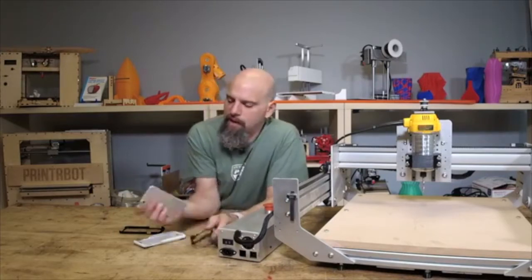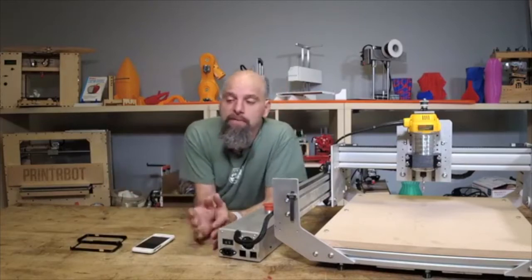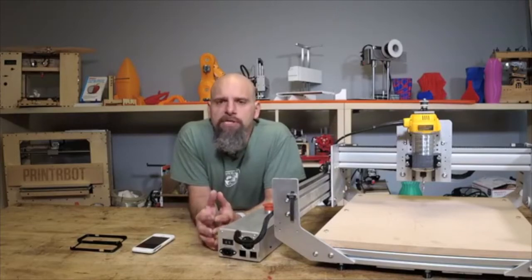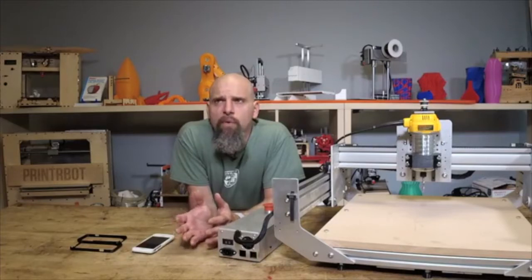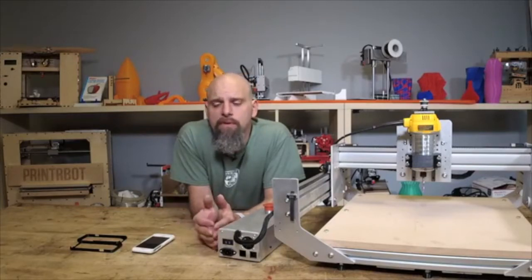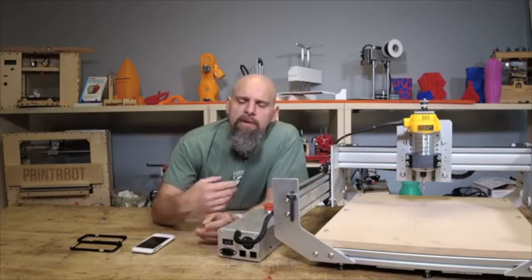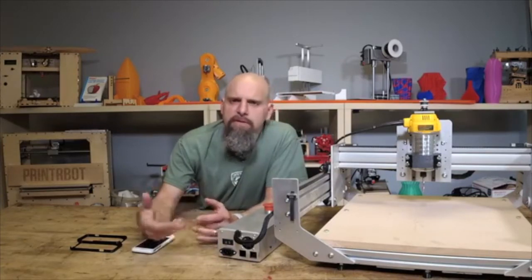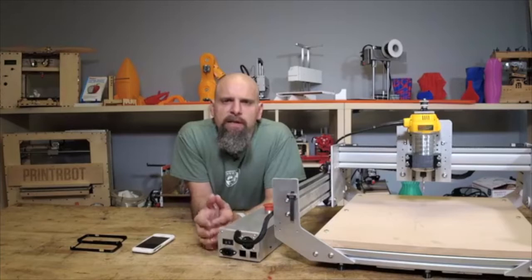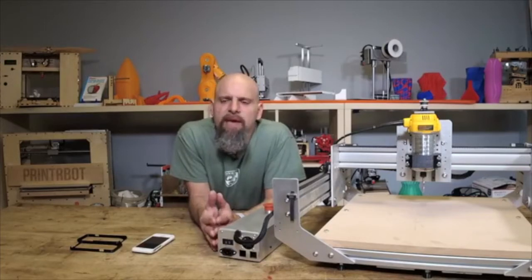Yes, there are a couple of things. There's actually a post-process. I'm getting into nitty-gritty details here, and nobody really cares, but I'll tell you why one piece is slow. When we started with the Tiny G board, they had what's called G2 dialect. If you go to the G2 Core wiki, they talk about a new way to talk to their firmware that rolls in all of the known CNC code and then extends it for things like temperatures and extruders for 3D printers. When we started, we had the cloud talking that G2 dialect, and it took a big post-processor on Cura 1.5 or 15 or whatever it is. And it was a big, long process.